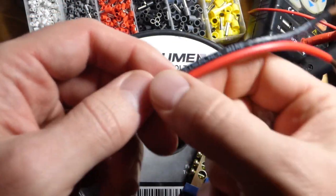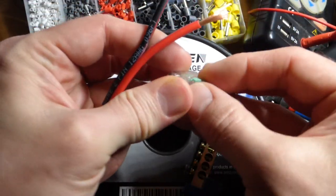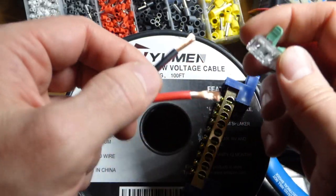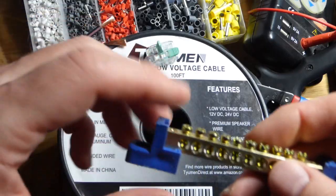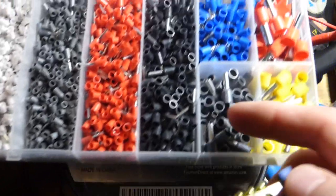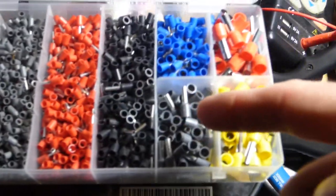When we cut the other side and strip the insulation, we need to hold the strands in place. Right now the strands are being held because it's a long run. The connector opens so we can insert the wire — I'll do that a little bit later. 12 gauge is the maximum wire for this connector, and this is 12 gauge wire, so it just barely fits and I have to struggle a little to get it in. So I got this terminal block instead, which does the same thing but you screw it down. I'm going to add a ferrule to one of the wires — this is 12 gauge so we use the gray ferrule, though 20 gauge is also gray but much smaller. 12 gauge won't fit in the 20-gauge ferrule, but it will fit in the correct one.